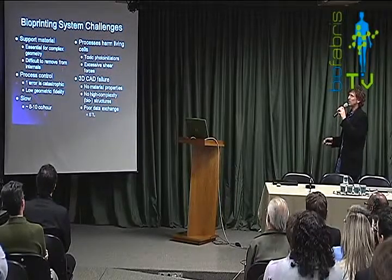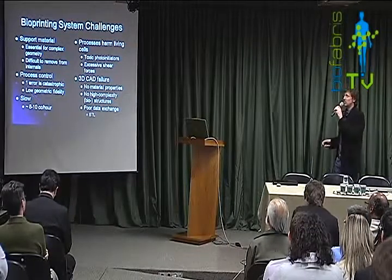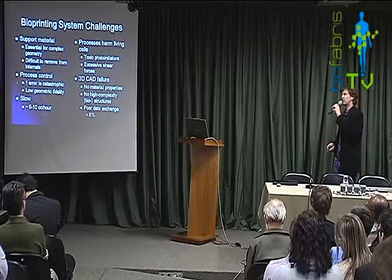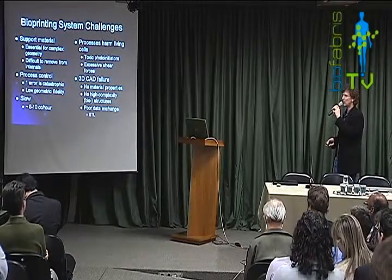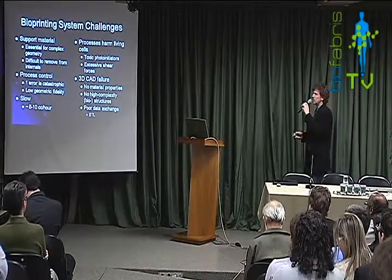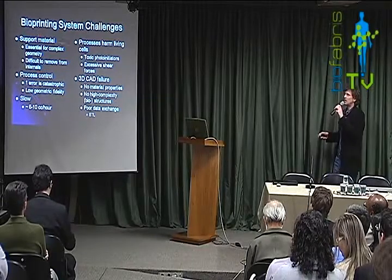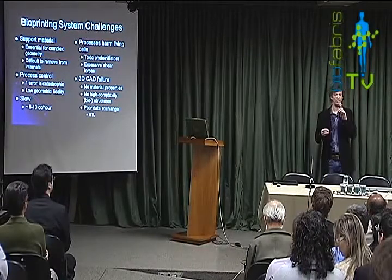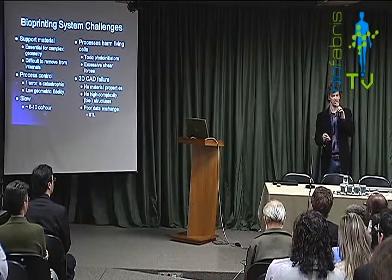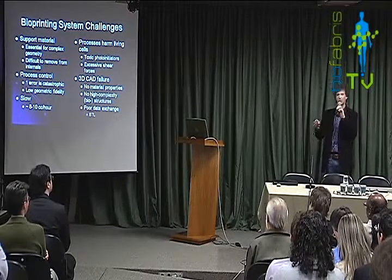So in conclusion here, there are a number of challenges I can see in bioprinting, and these span across the more complex multi-material, regardless of what the materials are, whether they're biomaterials or non-biomaterials. But one of the challenges that all these processes suffer from is needing to have support material if you really want to have freedom of geometry. So you notice that the fish robot was a very simple extruded shape with very slight tapers on it and so on, so that it wouldn't fall over.